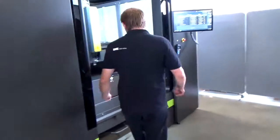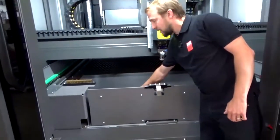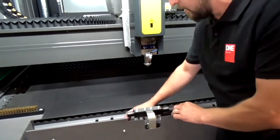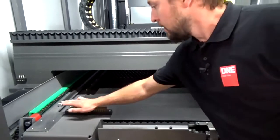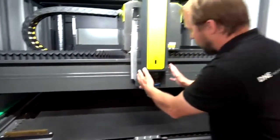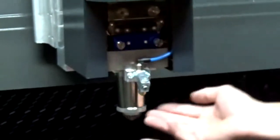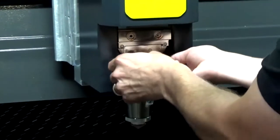Let's have a look at the front of the machine. As I mentioned, the lower table is inside the machine. Here we have the positioning system which clamps our table on the top or bottom depending on the configuration. We have a brush to clean our nozzle calibration plate. Here we have our cutting head — as you can see it's very narrow so we avoid collisions. And here we have a protective glass so that material going up doesn't land on our lens.